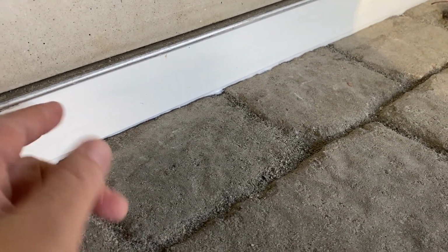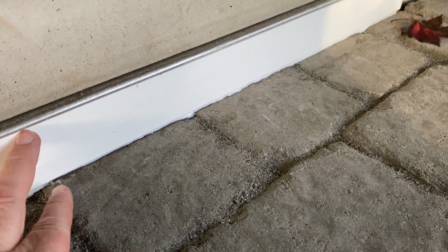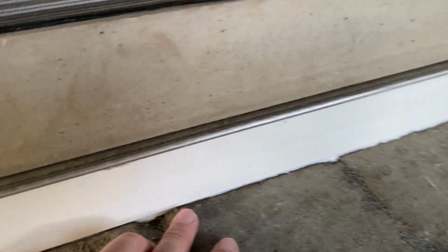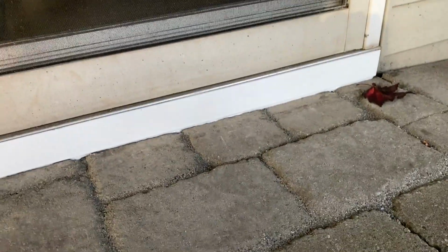This is the PVC trim. So this is basically a 3-inch trim, which technically comes up to 3.5 or 3 3/4, or I think I ripped it down. I'm sorry, 2.5, 2 3/4. I ripped it down to like 2 5/8 just to give some clearance, because over here you have a little bit more of a gap than we did here in the middle, just because of the way everything wasn't perfectly level. But it basically provides a nice little edging to it all.